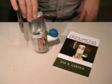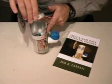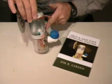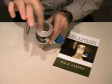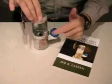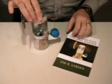In this step of construction of the quick and easy Stirling engine, I'm going to show you how to prepare this top section of the engine using a pop can. We're not going to cut this big hole until later. What we're going to do in this step is cut the top out of the can, and then poke a little hole right down in the bottom, and that'll be used for the displacer pushrod to pass through.